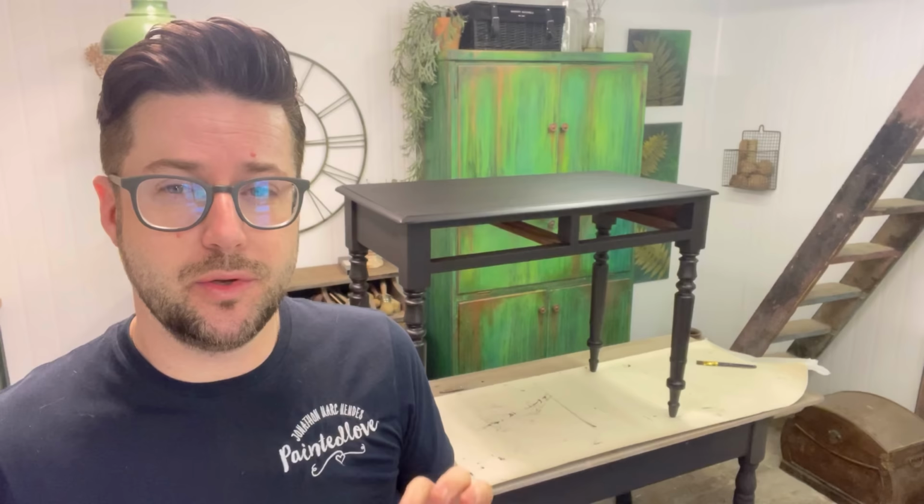I have painted the sides of the drawers. I would say be very mindful of the traction of the drawers when you're placing them back into your project, because it will take another 20 to 30 days to fully cure and harden. So be very mindful of that. There is something that you can do with that I will explain later on in the project. But now let's turn our attention to the drawer fronts.